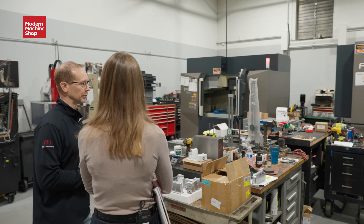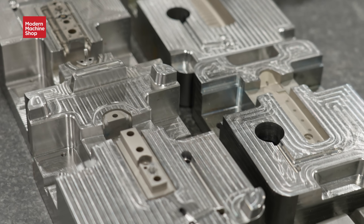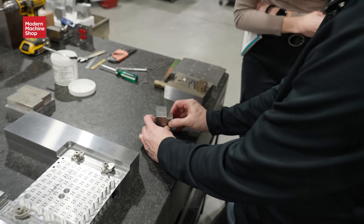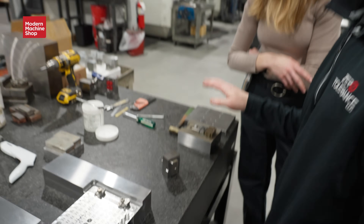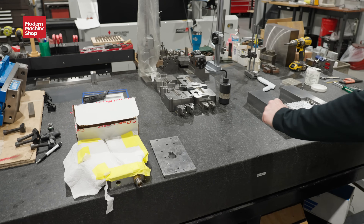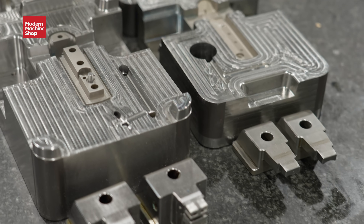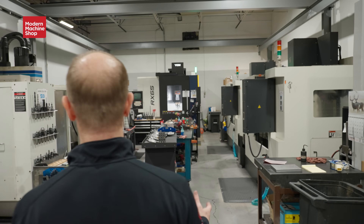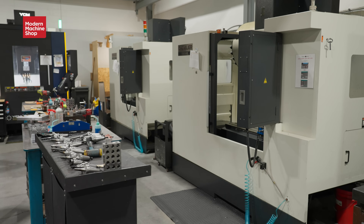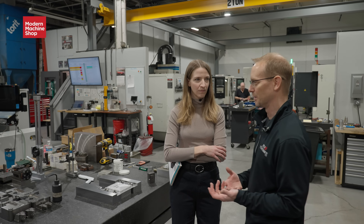It's amazing how much more you can do — it's more accurate, it's less setup. We get into some very interesting parts; we have some real accurate and intricate inserts. This is all wire EDM insert pockets. Here's another tool — it's for a gun component, but it's got slides that go in and make the part. We're doing an engineering change on it. We do all of our roughing and finishing in this area for hard milling.